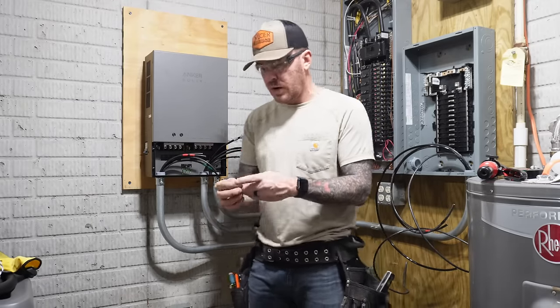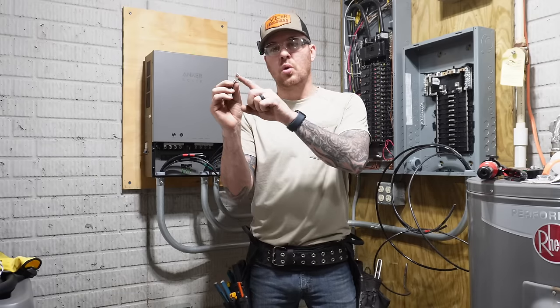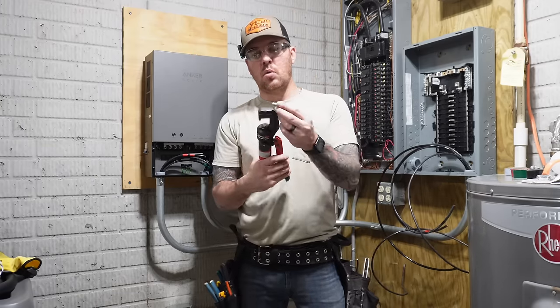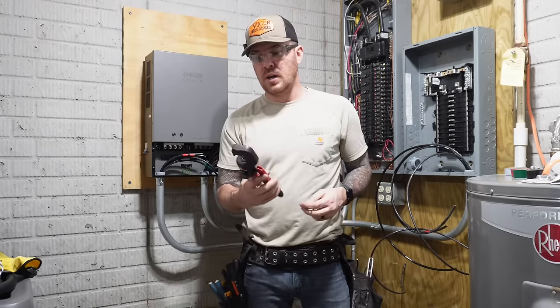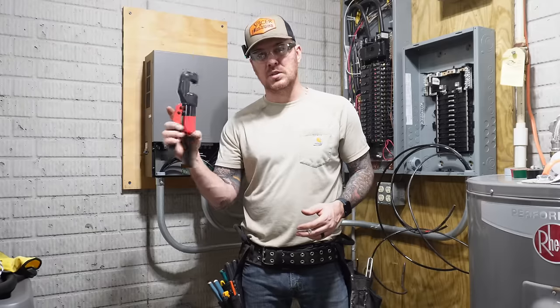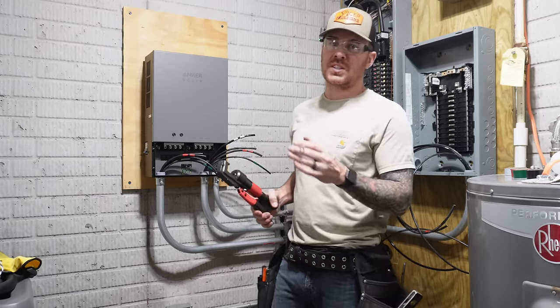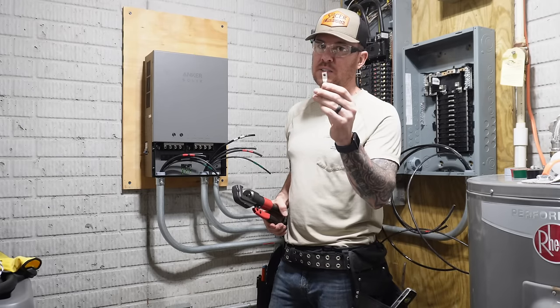These terminals require a lug. So I have a number 4 Burndy lug with a 1/4-inch hole on it. We will need a crimper in order to crimp this on to the end of the wire. I will leave links for this crimper down in the description. It's fairly inexpensive. It's just kind of a cheap knockoff one, but it works. We'll also need this crimper for the number 6 ground wire as well. We have to put a lug on that also.